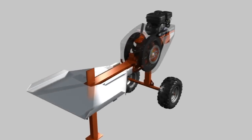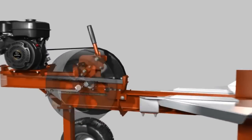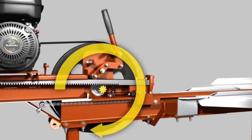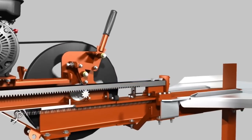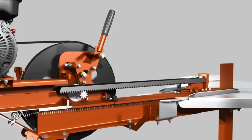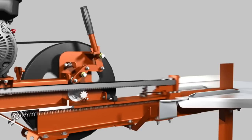Here's how it works. The pinion gear is located at the center of the flywheel, and the rack sits just above the pinion. When you engage the cam lever to split a log, the rack is pushed down into the machined teeth of the pinion gear. This launches the rack at high velocity, firing the log into the cutting knife. The log just doesn't have a chance.